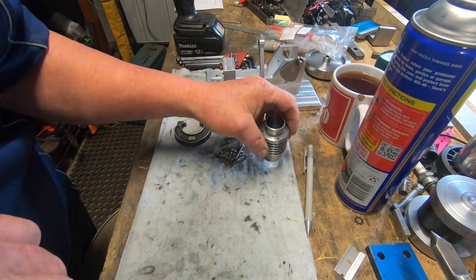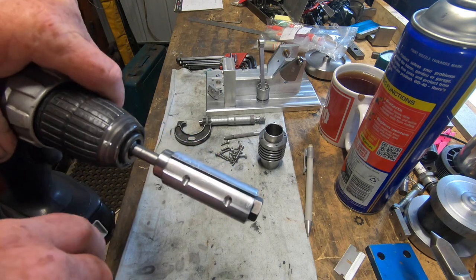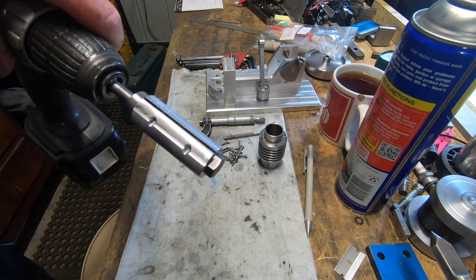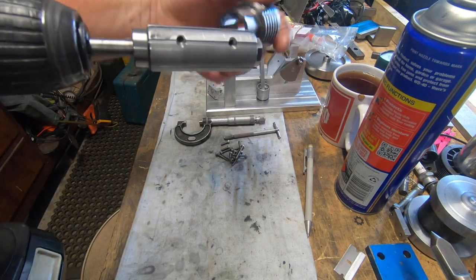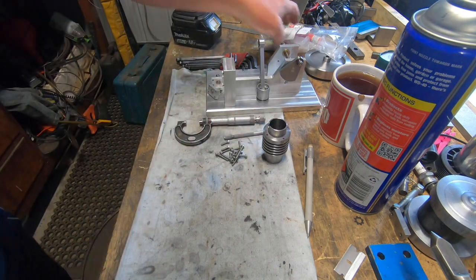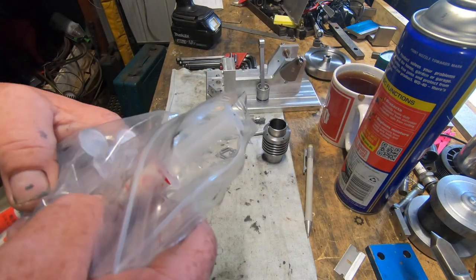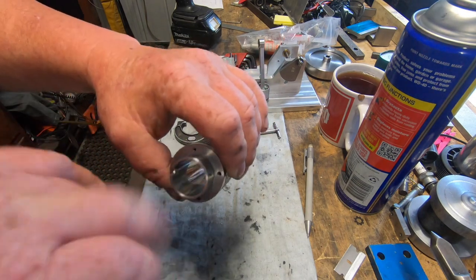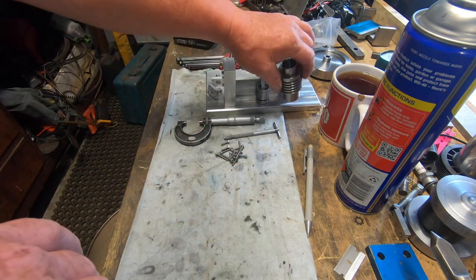I'm not gonna show lapping the cylinder because it's as boring as all shit. Prezzo showed it on his. If you want to know how you do it, you just dig it over the end, just go back and forwards, that's it. Started off with 10 micron and went down to 3.5, and it's like glass in there, it's as smooth as silk. I don't think it's worth going any finer, to be honest. I think it'd be plenty good enough as it is.